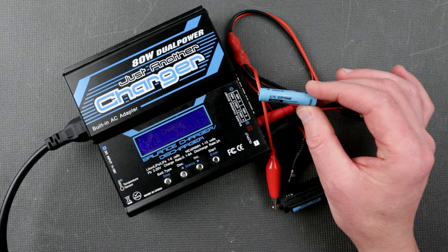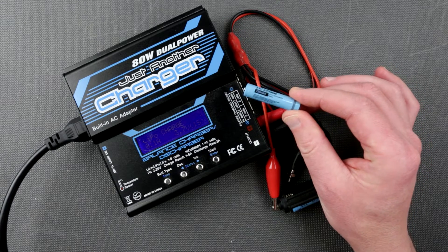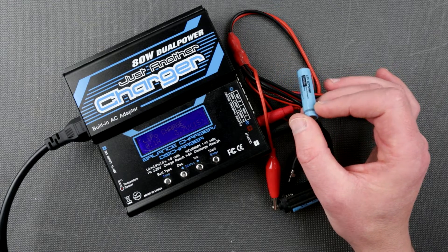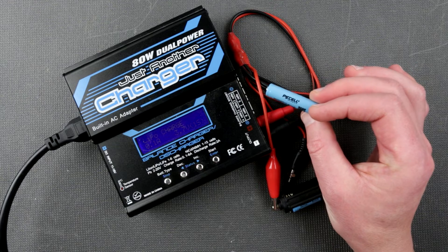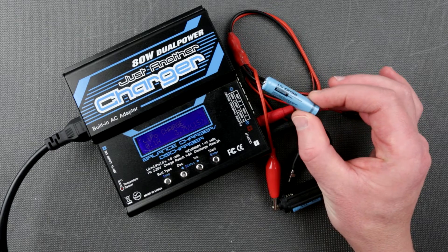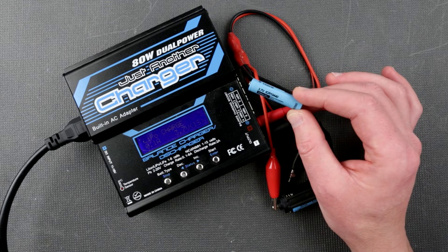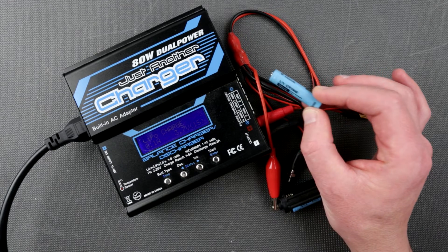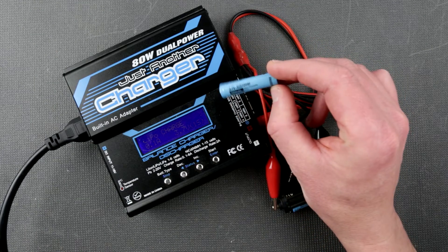This battery is borderline okay if you're desperate, but I'd suggest finding something else, because the actual capacity is less than stated. Unless they discharge all the way down to 2.7 volts to squeeze out the extra ~40mAh, I'm not sure I'd recommend this PKCell ICR 10440. Online there aren't many choices on Amazon, though there are lots on eBay and Alibaba — but quality is unknown and returns are difficult.